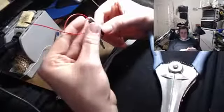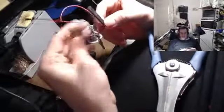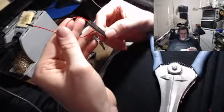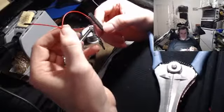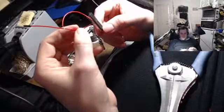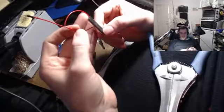5-volt output and provide 5 volts to this 328P ATMEGA, which is made by Atmel AVR. Now, next step, we've got to provide a link from here to the reset pin.